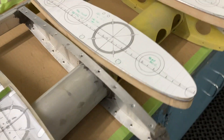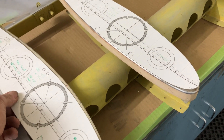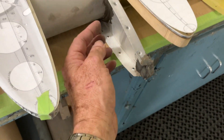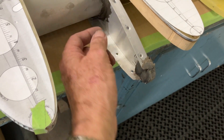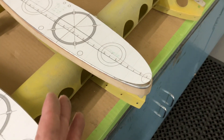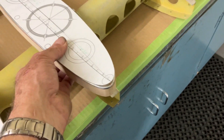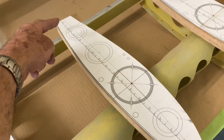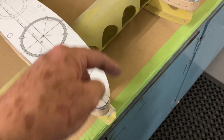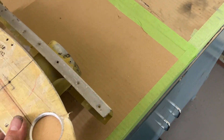That's the wet end of the wet wing. This one I leave solid when I form it in the rubber press — I'll form the lightening holes to give it rigidity, but I don't need to punch the holes in the middle because it's a solid rib. Once again I'll just cut off the flange and rivet the new rib to the end. Similarly, each of the ribs gets replaced from the spar forward with the new shape; behind the spar it's exactly the same shape, so there's no need to replace it — saving a heap of work and a heap of aluminium.